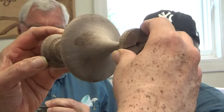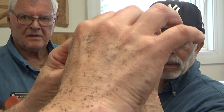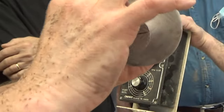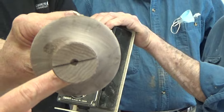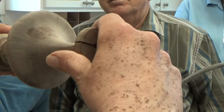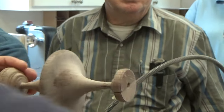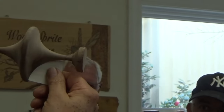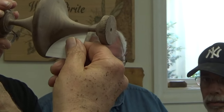There are risks associated with choosing a blade width that's very, very thin. This is already pretty thin, and if I want the selvedge to be a little bit thinner so I know exactly where to cut and where to sand to, I have the risk that it will twist right off. Ladies and gentlemen — voila, perfect. It's not hard. You just make small strokes and frequent corrections, and you get there, no problem.